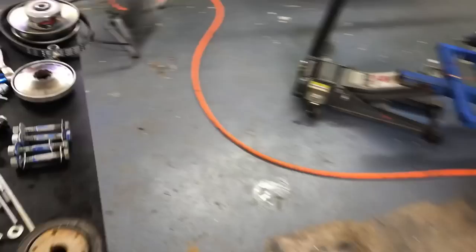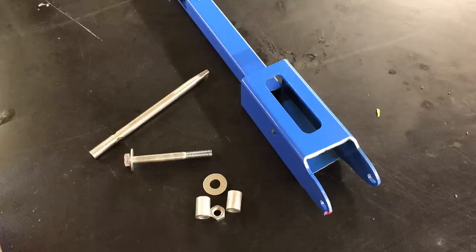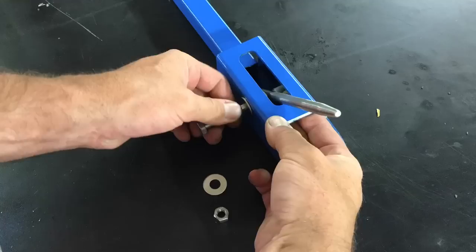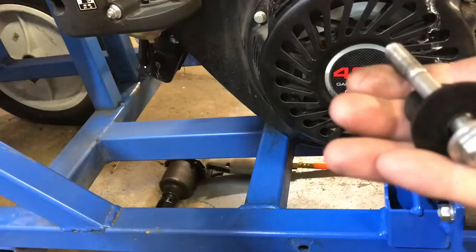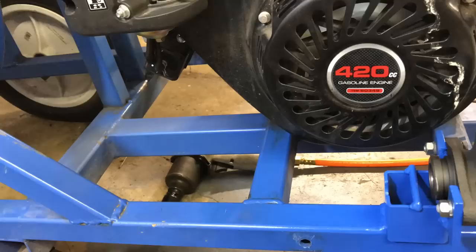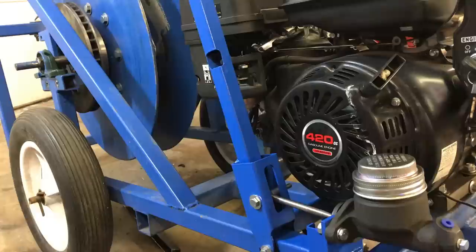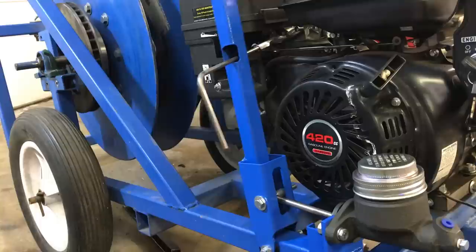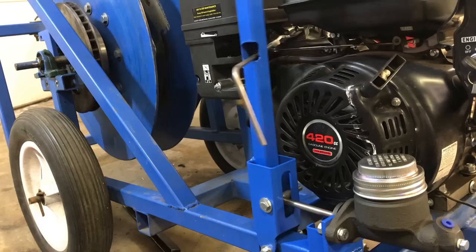In the meantime, I got to put together the control arm. The previous control arm on my tow machine was just half of an old push lawnmower handle, so it needed a full rebuild. This is a full custom. I wanted one-hand operation — that's important to me because usually I have a radio in one hand, and I designed this so that I can operate the throttle and the brake. I made some special hardware, some plastic nuts for the lever arm so it all goes together smoothly. The nylon washers put in between two pieces of steel cause it to slide nicely — the motion is smooth as butter. The little peg is what actuates the brake and I use a very simple throttle. Simple is better. I know it looks kind of ghetto, but it worked great and has worked for years, so I kept this simple little design.